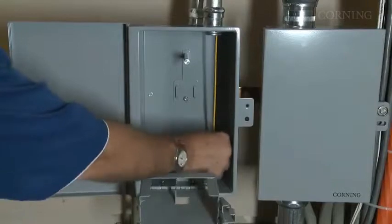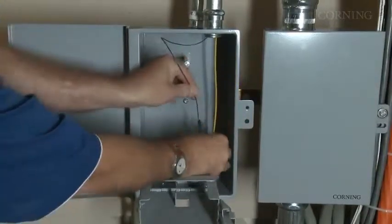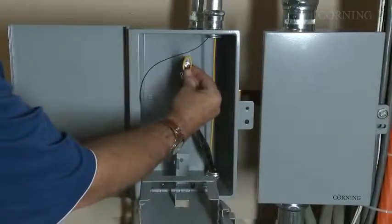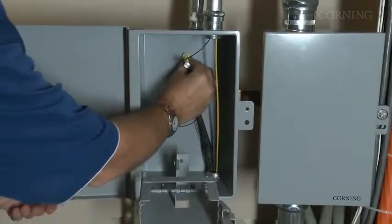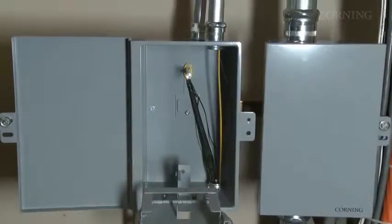Moving to the next box one floor down, lift up the black pull line until the next cable's pulling eye appears. The clip spacing is designed to be greater than typical vertical floor spacing. Like you did on the floor above, secure and connect the cable to this floor's box. If a floor's connection is not yet needed, you can place the cable's pulling eye over the aluminum post to temporarily secure it until needed.